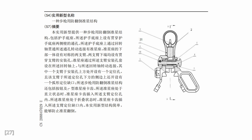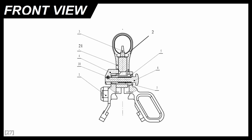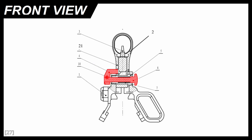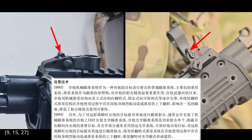This patent is for the front sight folding mechanism. There's a detent to keep tension on the front sight in both the folded and unfolded positions. In addition, the pivot on the front sight tower has a spring-loaded pin with a finger that locks the front sight tower in place. You unlock the front sight by pushing in this pin, which removes the finger from the locking hole. You can see in actual photos that the front sight is locked when folded and also unfolded. The patent states that both positions should be locked to prevent the front sight from either flipping open under recoil and obstructing the optic, or folding down when you need to use it.